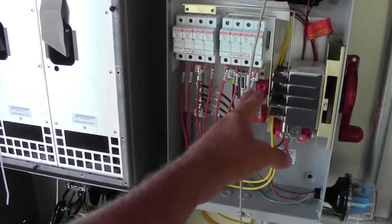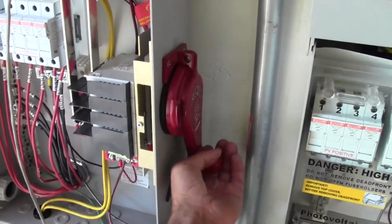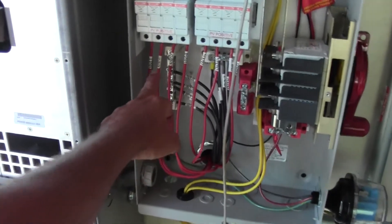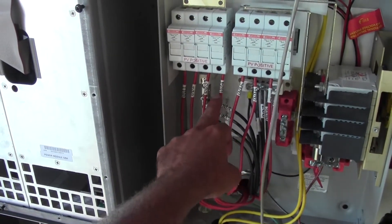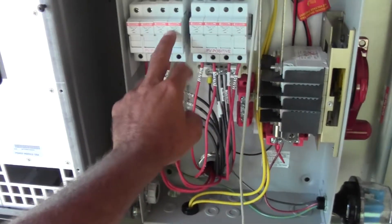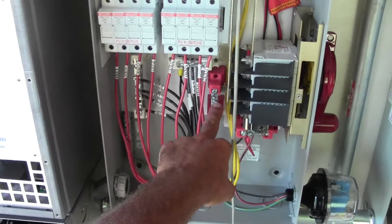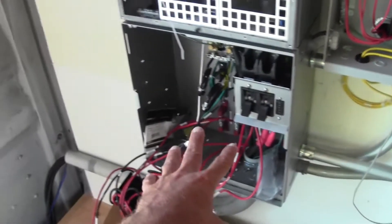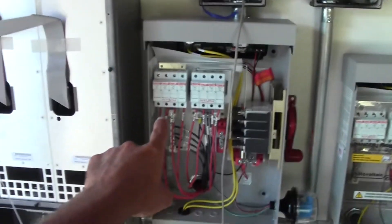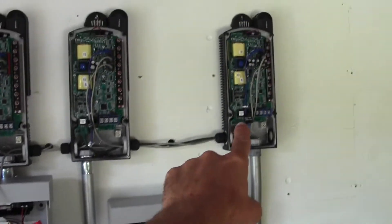Just like the name says, it combines all of the circuits — all 13 circuits. Eight of them here and five more over here. It combines them all and makes it simple to disconnect the power from the roof. Basically the way this works is each one of these lines has about 102 volts — about 36 times three. So about 102 volts, positive and negative. We take four of the panels and combine all that output into one circuit here. A positive and negative cable goes down into the load center, and then runs back out through conduits into the charge controller. The first four go into one charge controller, the next four into another, and the last five combined will go into the third charge controller.